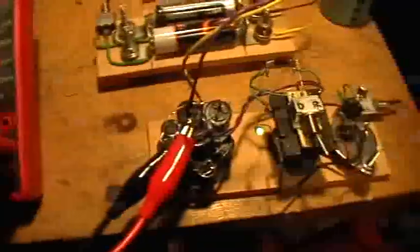In the two-battery position, that green LED at 1.57 volts starts turning orange — anyone who's worked with green LEDs knows that when they turn orange they're about to pop. I don't want to stress it; I've already blown out all my white LEDs and a couple of 2N2222 transistors. But I finally think I understand what's going on with this circuit. Right now at 1.12 volts the LED is glowing nicely. Turning off the battery, it takes a moment for the LED to dim — perfectly ordinary normal behavior.